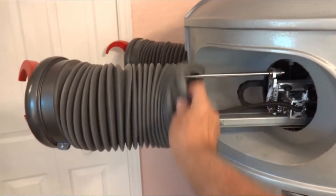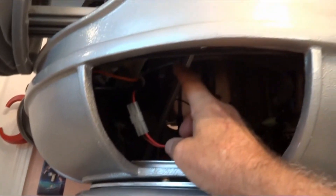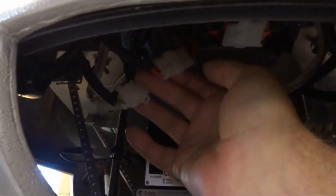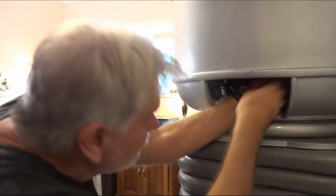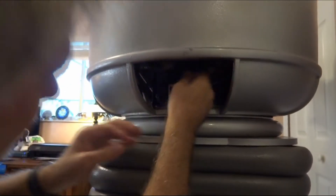Next we're going to take the arm off. It slides right out the front, but there are four wing nuts — two in the front and two in the aft — to undo, and then the whole thing will lift up. But before you do that, we have to unplug. Down here you'll see there are three plugs per arm. You come in through the rear vent and undo those three plugs. Again, they're different plugs — they're backwards from each other — so you'll never get them mixed up. They're just Molex connectors. They come apart very easy — three on this side and three on this side for the arms.